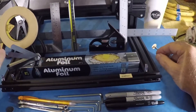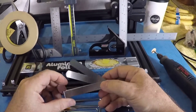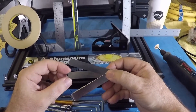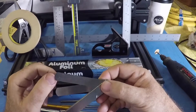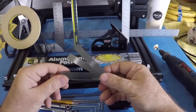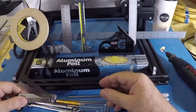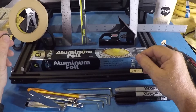Another thing I like to use is a feeler gauge. Everybody sets their tramming height — bed leveling — by using the paper method, which is fine. A standard sheet of paper, A4, has a thickness of 0.10 millimeters. I like to set my hot end down a little bit closer, so I'm currently using 0.06 or 0.05 depending on how well my machine's been adjusted. I just feel like I get better adhesion on my glass build plate by using these. A lot of old-school mechanics and machinists still use the paper method, and that's fine, but I just wanted something a little bit less than 0.1.